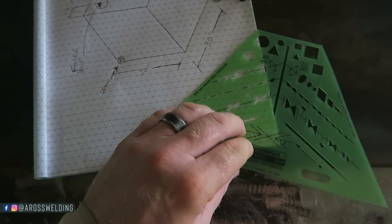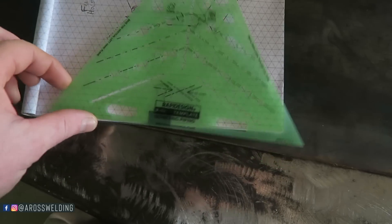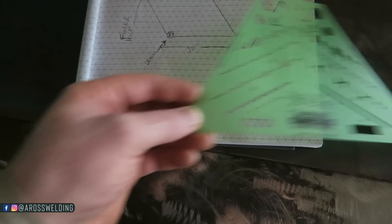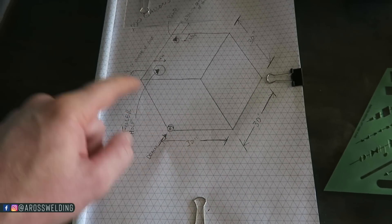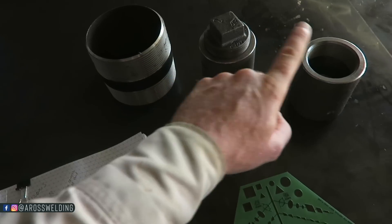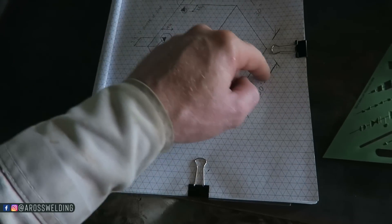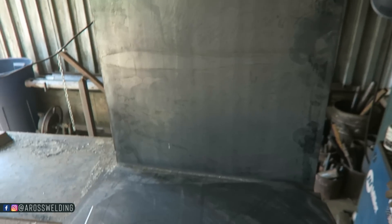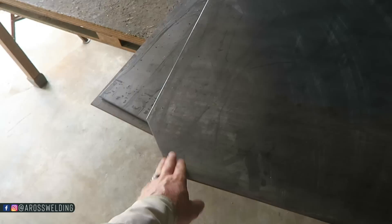I used the clear lens, and also this apparatus here to draw the circles — I think I got this off Amazon, we'll put a link in the description. It's super handy to draw straight lines, but just a basic square. Got a drain, got a four-inch nipple that he's going to use as a filler, two-inch drain, and a two-inch coupler for where the pump is going to mount. I'm also going to be putting a baffle in here. For those of you who do not know, a baffle is put in a lot of bigger fuel tanks to keep the fuel from sloshing around — for example if it's on a trailer or even your truck. This piece here is the baffle.